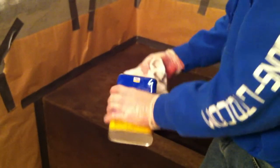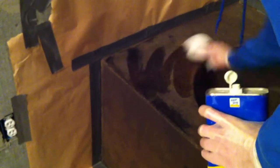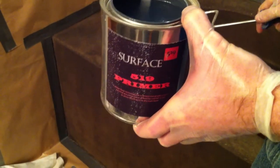The first thing to do before applying the Rocktop CT is to apply acetone to all the concrete surface. We're going to also use the Rocktop primer, which increases adhesion and reduces the amount of pinholes or small little bubbles that would be in the surface of the finished sealer.